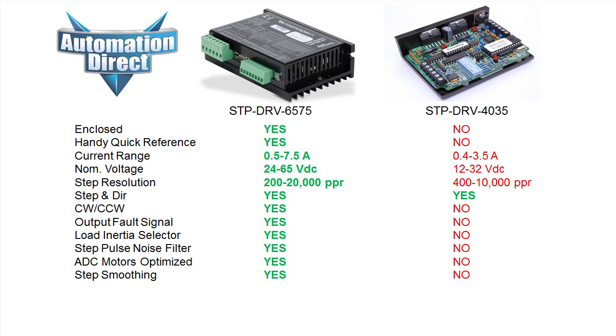In full step mode, while the stepping is usually very coarse, there is a switch selectable step smoothing option which approximates microstepping so you get the best of both worlds — smooth operation at both high and low speeds. This unit has removable plugs, so now you can swap out drives without having to rewire. Just unplug the drive and plug a new one in.